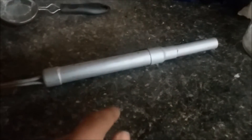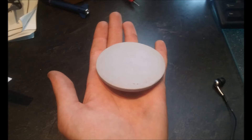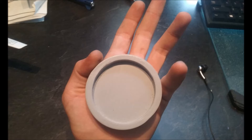I'll put some pictures and commentary on the new rocket engine right here. The plan with the new rocket engine I designed was to be able to 3D print all the parts and use them as molds to actually cast it out of the finished material. Here are the 3D printed parts — there are three of them. This part here is the top, which will be the very top of the combustion chamber. This right here is the injector plate, which will have a ton of little holes drilled into it to be able to spray and mix the fuel and oxidizer.